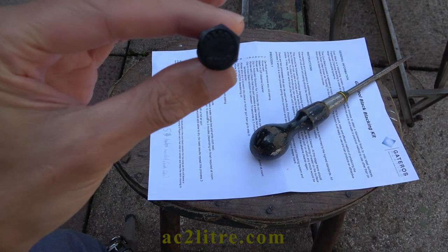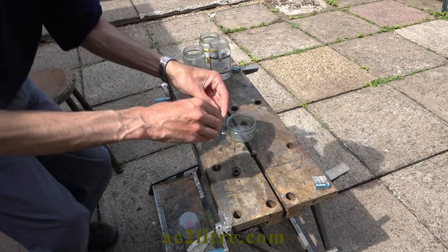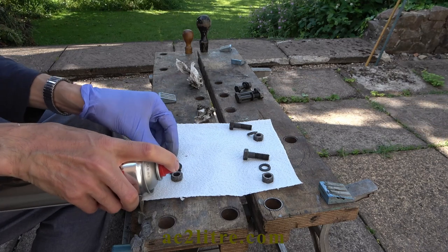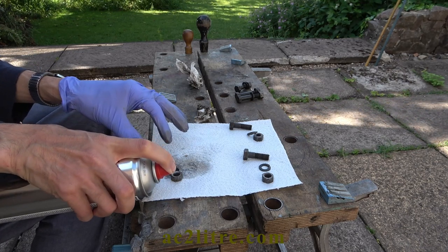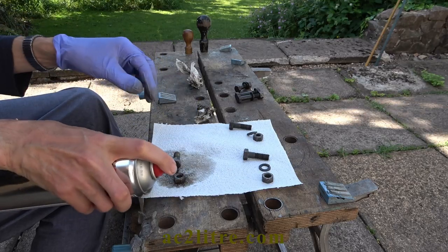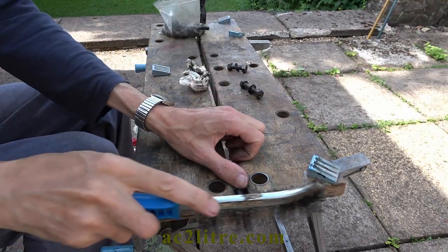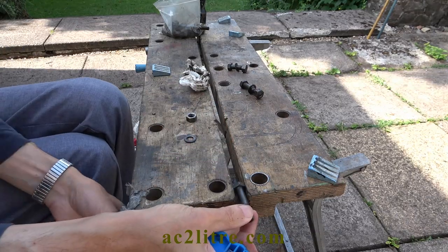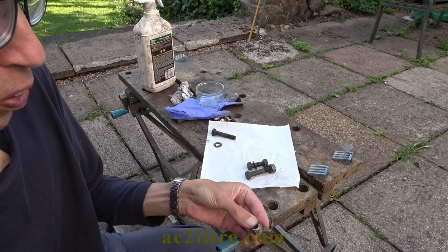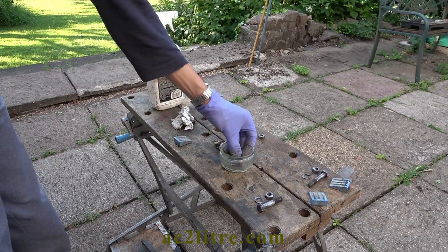It's a cold process, making it a bit easier for us amateurs. Firstly you need to get the components very clean. After wiping down I used some solvent cleaner. It's best to remove oil and grease before cleaning with abrasives to avoid grinding any oil into the metal. Then I used solvent cleaner again, followed up with an alkaline cleaner — POR15's metal cleaner.